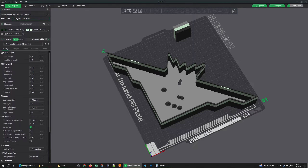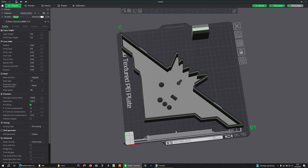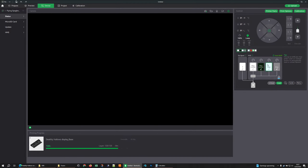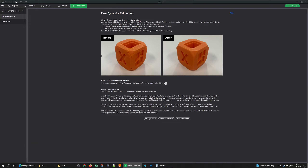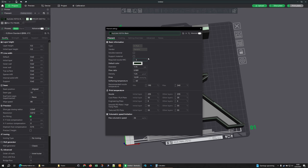So far we've covered: using a textured PEI plate — absolutely essential for light boxes to look good, because smooth plates make the faces look terrible. We've talked about filaments and important settings. Now we're getting into process settings. There are a couple of different sections in your slicer to be familiar with. This entire time we've been in the prepare tab — that's where filaments, process settings, and everything lives. I've gone over to the device tab a few times to show AMS and calibration settings. Inside the prepare tab is where all your material-specific and process settings live.